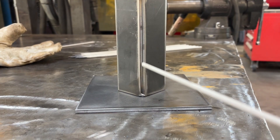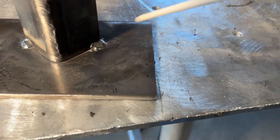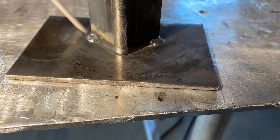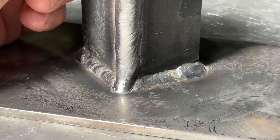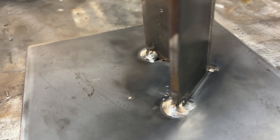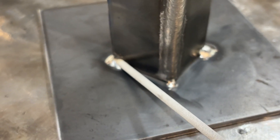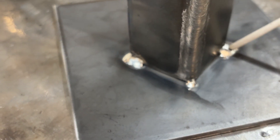Number 1: first thing will be to perform this vertical weld. After this one is complete, you want to wrap your start, giving it an almost seamless look. Leaving this weld until the end will cause an oversized button you will need to grind down afterwards. Number 2: you want to wrap your corners. A lot of welders don't know to wrap their corners, or out of sheer laziness refuse to go around. This doesn't have to be a continuous weld around — I like to wrap the corners, then fill in on each side.